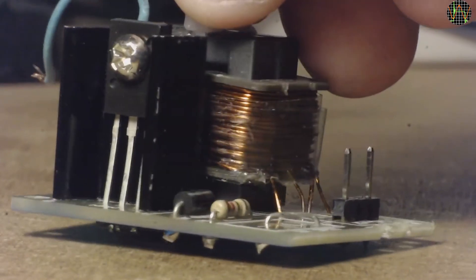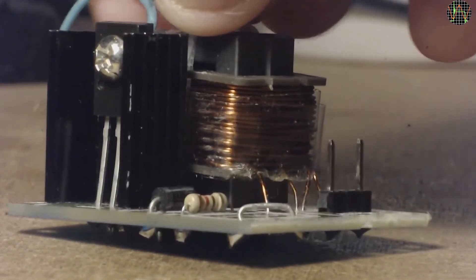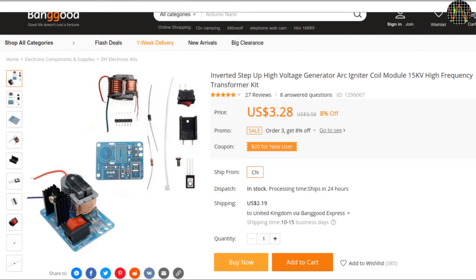And a little bit of trouble figuring things out, but that's all part of the fun. It's available from lots of places, but I got mine from Banggood. The most intriguing part for me was this nice looking transformer, which really looks like it means business — its high voltage secondary has actually been split into individual segments, which is a good thing to prevent arcing.